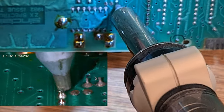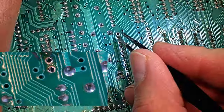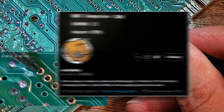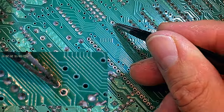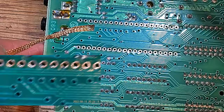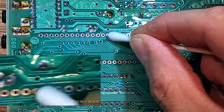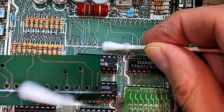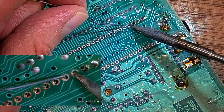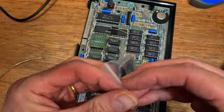The other big source of heat, especially in this one, is the ULA. These are socketed from the factory, which makes installing a heatsink difficult as there's not enough room under the top of the case for it and the socket. It's possible to install a low-profile heatsink, but the more standard way to deal with this problem is to remove the socket and solder the ULA directly to the board. I used to feel this was far too risky, but now I have my trusty desoldering station I feel much more confident. In goes the chip, out goes the socket, and on goes the new heatsink.